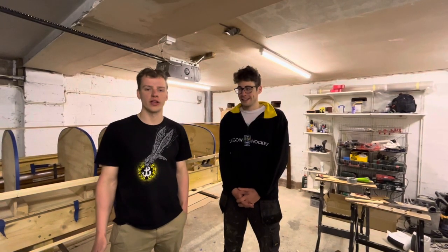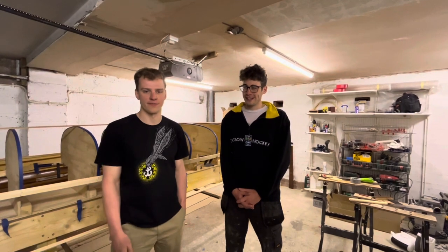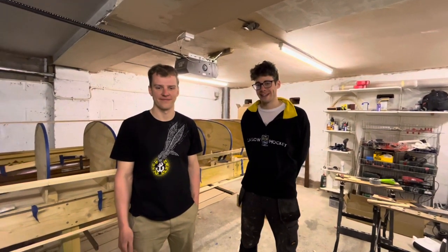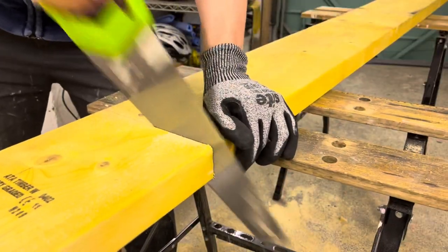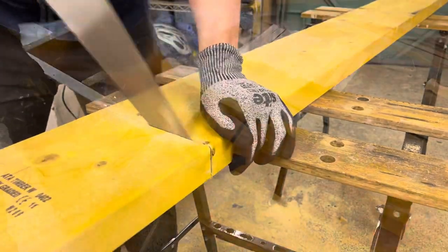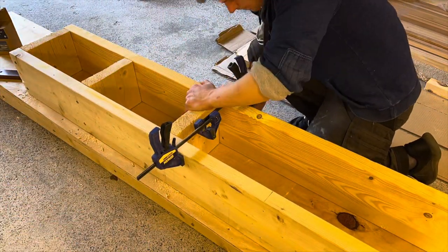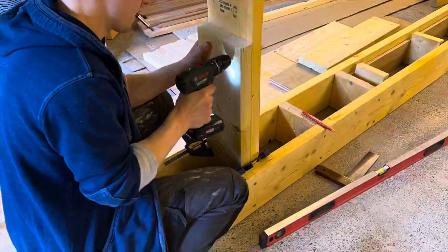In this episode we'll be looking at how we built the Strongback frame, and then how we cut out the stations and fitted them onto the Strongback. The Strongback is like a table on which a canoe is built. It needs to be strong and stable, and most importantly, straight and level to ensure accuracy in the mould.